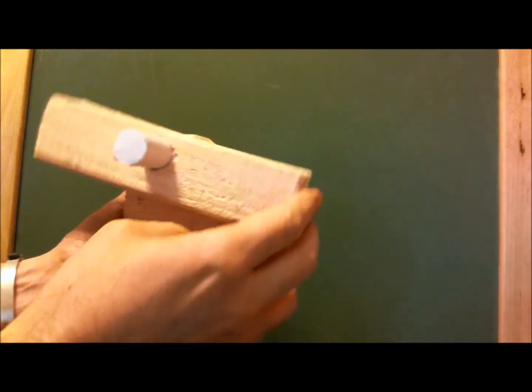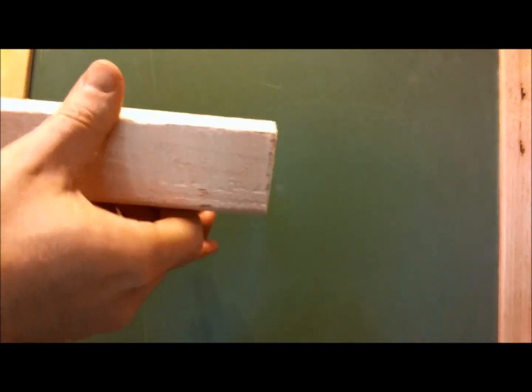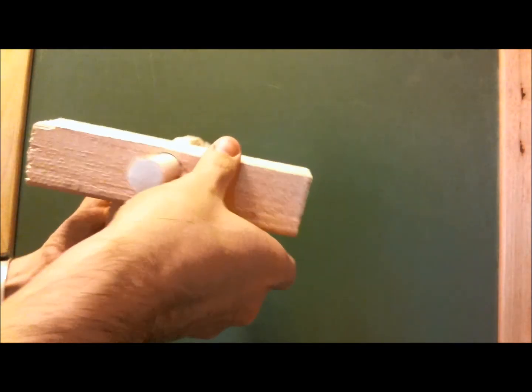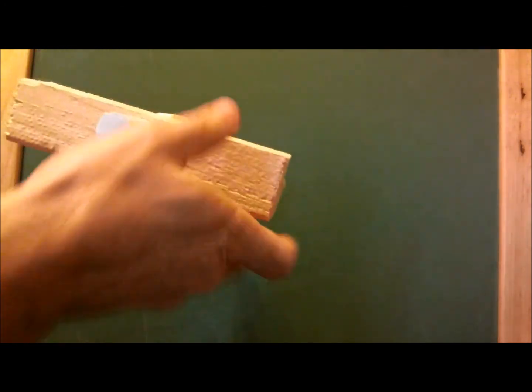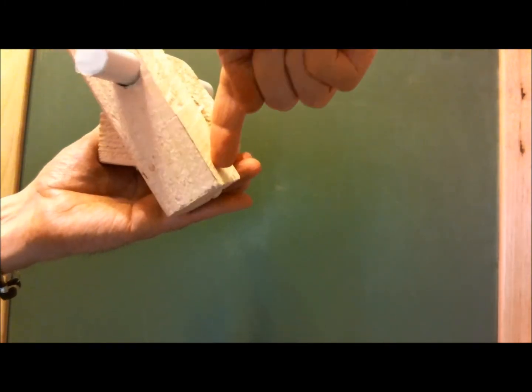So a pin joint has reactionary forces that prevent translation of this part to the left and right, up and down, as well as in and out of the board. But if we assume frictionless, there's nothing that resists any torque, so that even the smallest amount of force acting on the side will cause rotation.